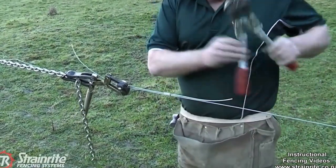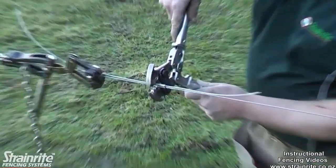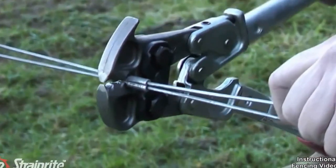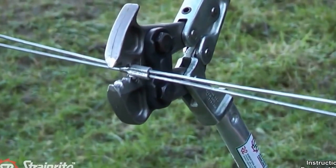Get the easy pull tool. Always start at one end of the crimp and work your way along — get it in the position there, put it on and just rest it on your leg, pull that wire tight, and then crimp down once you've got it started. Just keep working your way along the crimp sleeve.